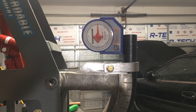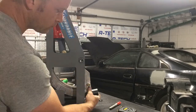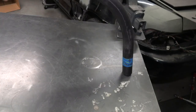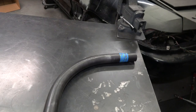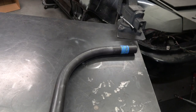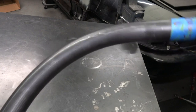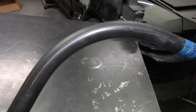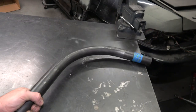That looks like 90 degrees. Let's take it out of the bender and see how the actual bend looks. Here's the outcome — it came up as 90 degrees in the bender and did have some springback, so probably a little less than 90. Overall I'm impressed — really no kinking, no major concerns. For what it's worth, it worked for my specific needs, though a tighter bend would have been nicer in other circumstances.